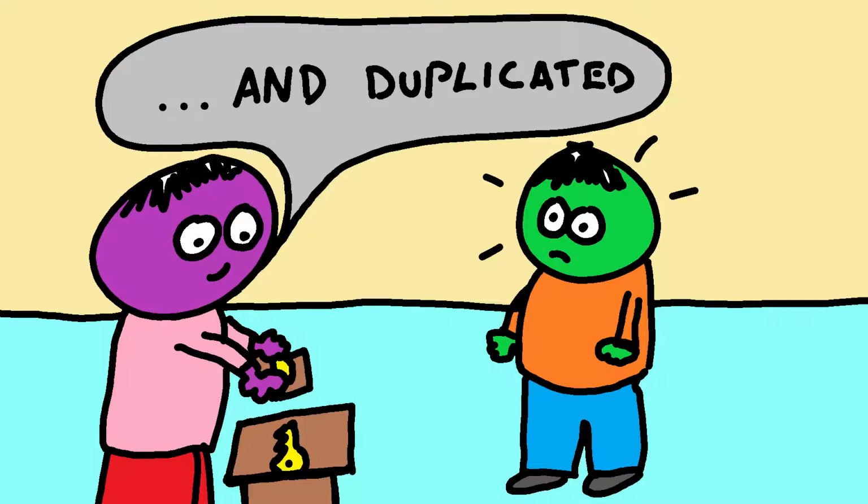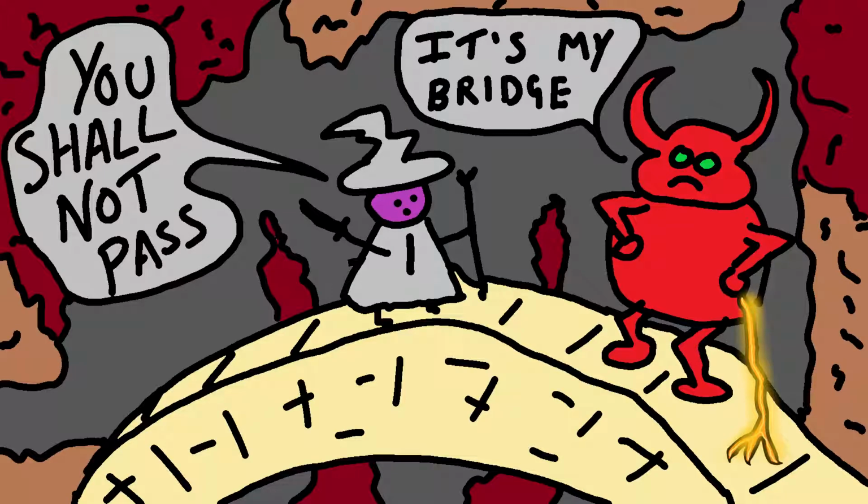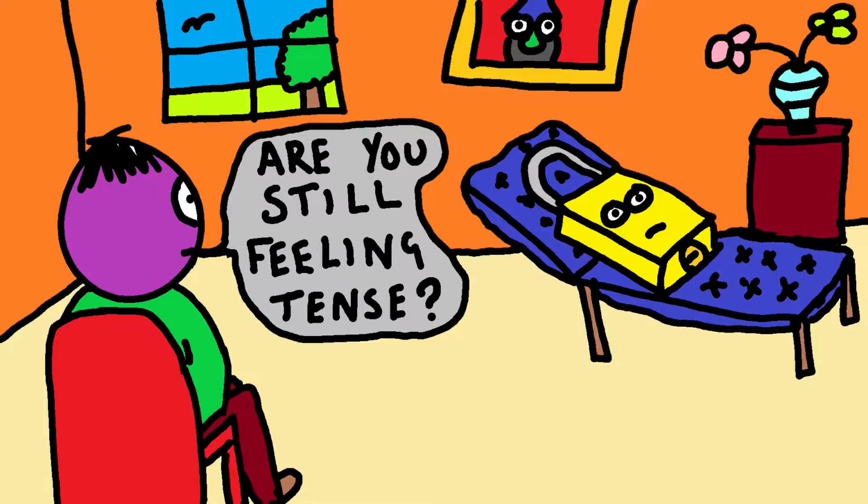The next problem to address is with the lock itself. Most locks work in similar ways in that they have an opening that leads directly to the mechanism. Ideally, you would want to make it as difficult as possible for pickers to get access to this, but this is rarely the case. Worryingly, a set of pocket-sized lock-picking tools will allow an experienced picker to open most locks. Lastly, lock pickers usually need to apply tension to a lock mechanism in order to pick it open. This tension on the mechanism makes it possible to keep individual pins in place as others are being manipulated. If a lock cannot be tensioned, then picking it becomes much more difficult.